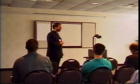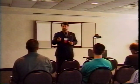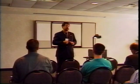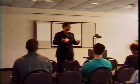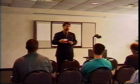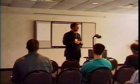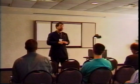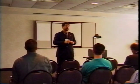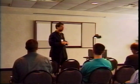And speaking of reversing, in order to save time, the watchmaker winds the watch up, and you have your 270 plus degrees amplitude. You can do your dynamic poise at your higher amplitude, and then your rules just reverse again. Fast is light in that situation as opposed to fast being heavy. Fast is light, yeah.